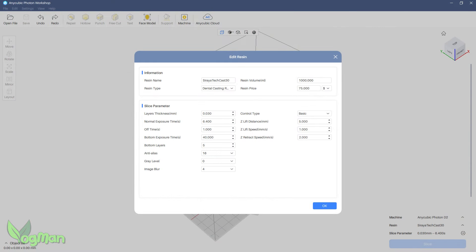When it comes to curing the prints, I have just two rules. The first is to cure very well — I'm talking at least half an hour under the UV lights, and more if it's a thicker print. The second hasn't changed from my previous video: use Vegetable Glycerine. This is a pain, I'll be honest, but if you don't use it — and I've heard from people who claim that they don't — you do risk spoiling the casting.